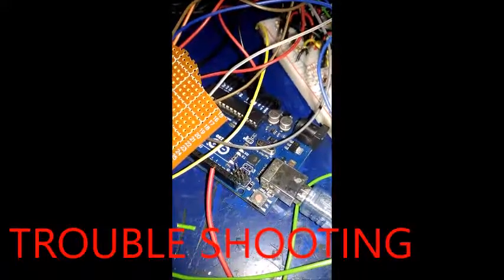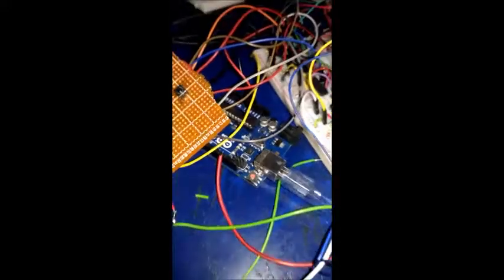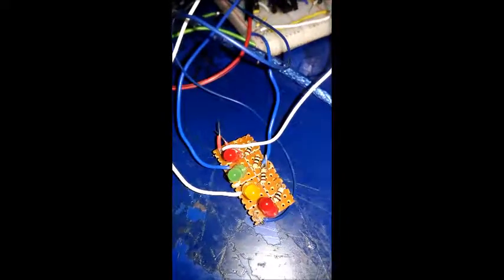The problem of the system is that it does not save properly. This is due to the multiplexer's inability to distinguish which quad D flip-flop out of the three can be saved. When a certain multiplexer out of the three is high, the other must be low.